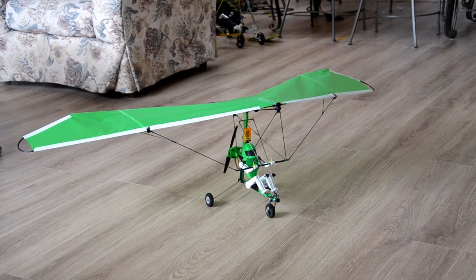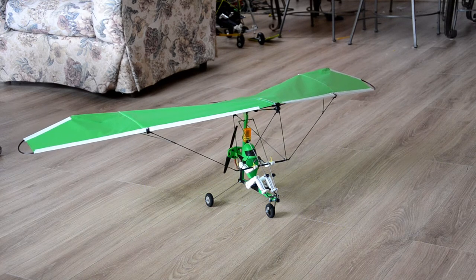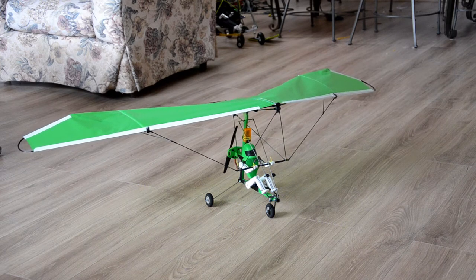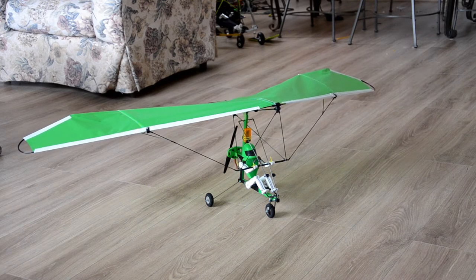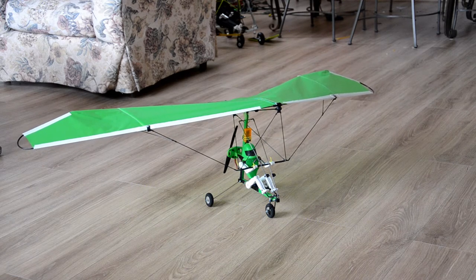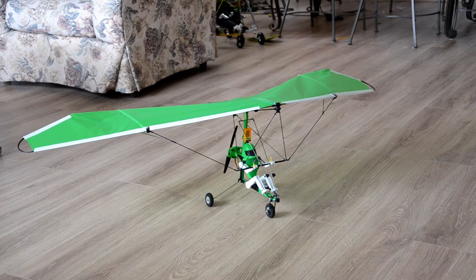If you keep the wing on any model very lightweight, your aircraft is going to perform a lot better than with a heavy wing. So the wing in this particular model has been enhanced with a sewn leading edge using Dacron sleeving material, and that's the white parts that you see on the wing. So all the white trim is Dacron trim that has been sewn. This is not taped as the original one was. The original one used ABS sleeving for the leading edges to support the leading edge rods and also to support the trailing edge wing tips, and it was simply double side taped to the wing. Although we used industrial quality double-sided tape, it was great, but nothing beats a sewn leading edge sleeve. So that's one of the new things that we're doing with this wing.